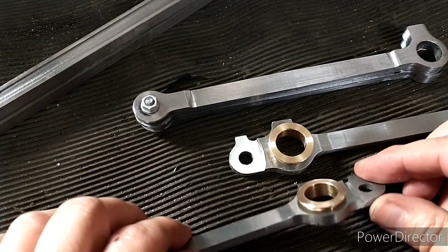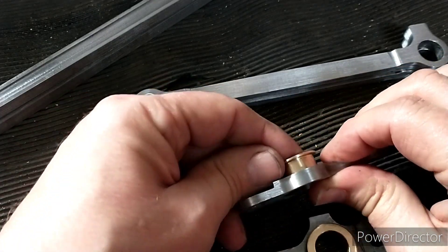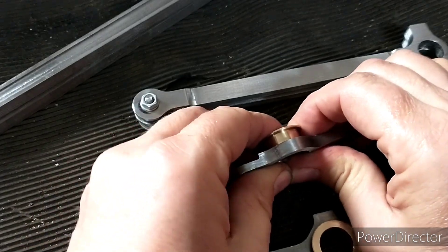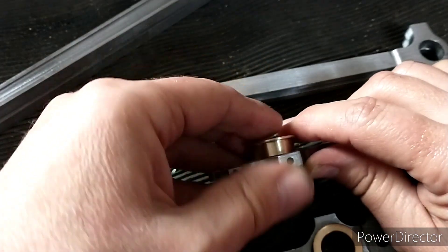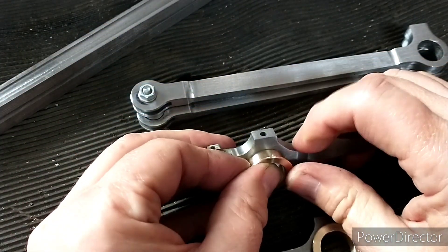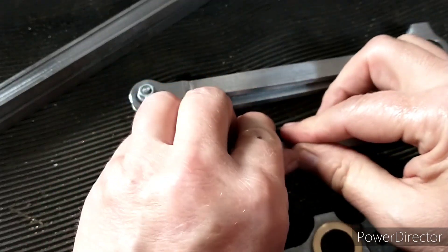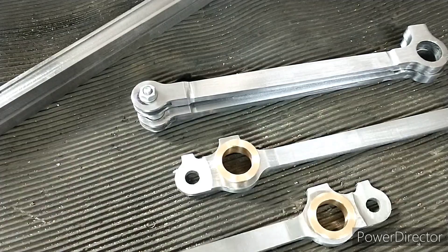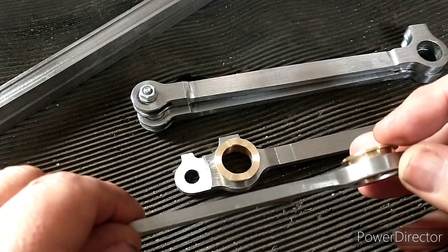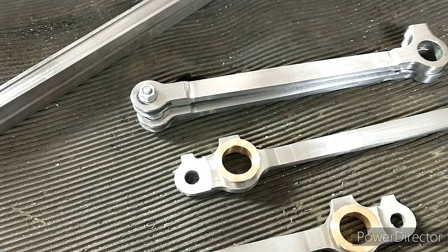That's the first two done. This one is a really nice sliding fit. This one can't quite get it lined up straight but it's just a very slight press fit - they wanted to go in before. I'm not sure if it got distorted but that will definitely push in. I'll warm this up very slightly, but yeah, generally I'm very pleased with those. I'm going to pop just a drop of Loctite on that one and press it in, then we'll see how it looks on the loco.